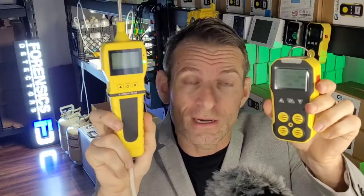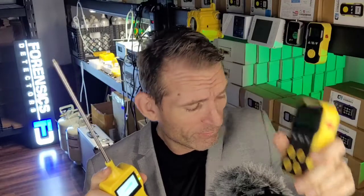Can you add a pump to the FD4A and FD4S for point sampling? Yes, you can — we sell it with our electronic pump on our website. The detectors all come with a calibration cap; you pop on the tube, press the button, the pump draws air from the end, and you can do point sampling. This works for both the 4A and 4S, and it's very cost-effective.